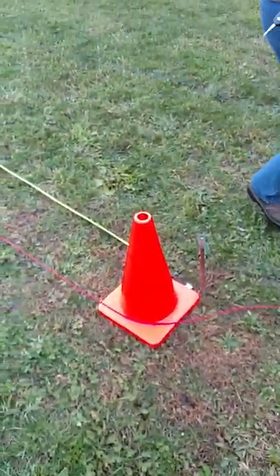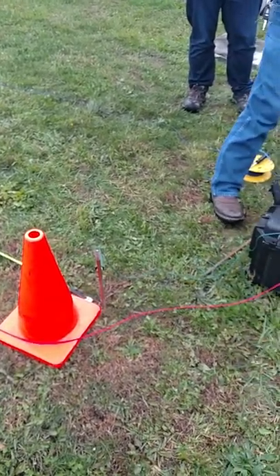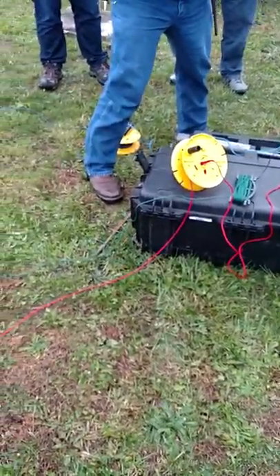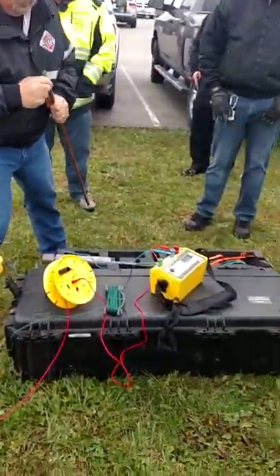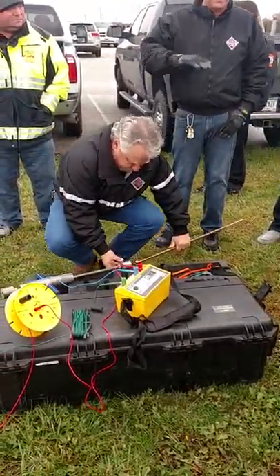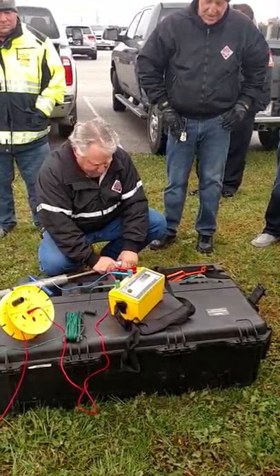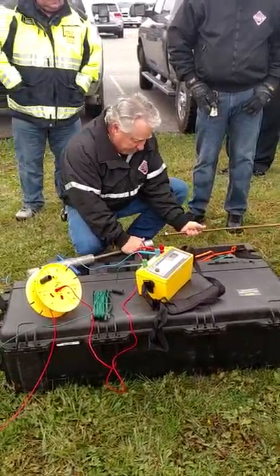If we needed to be below 44 — technically right now we're within range — but you're looking for 100 or less? We're looking for 100 or less. The OSHA standard is 25; optimum would be 25. That agrees with the National Electric Code. But keep in mind, all those codes are written because you've got an active energy field, not something that's a static energy field. This energy field is just designed to dump static electricity.